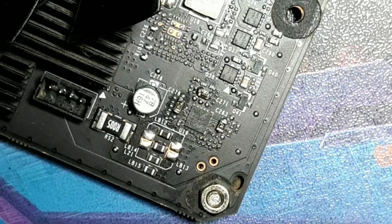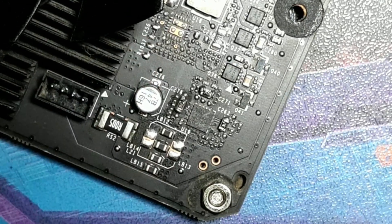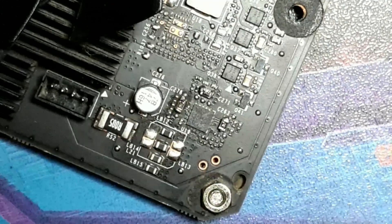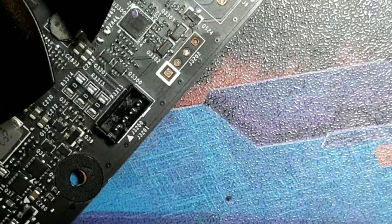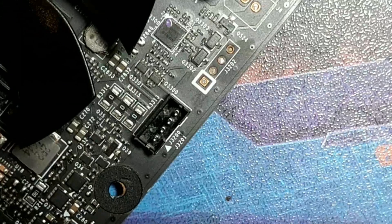If you do all three shunts, power will also come from the PCI Express slot, and it will make the card read very little power draw. If you overclock with a core voltage mod - which I believe the pads are somewhere over here - I'm going to have to solder wires to those contact pads. I may have to recheck since they could be higher up on the board. I haven't searched it yet because I'm only testing the no power limit mod right now.